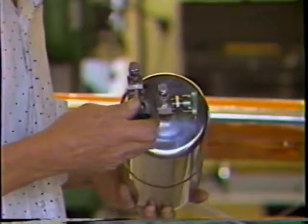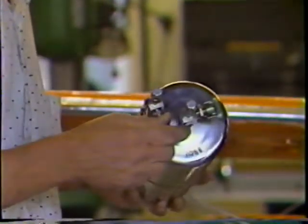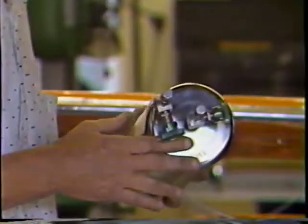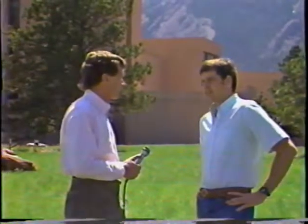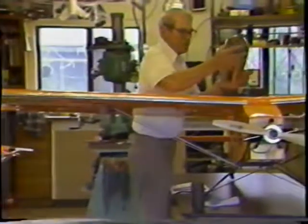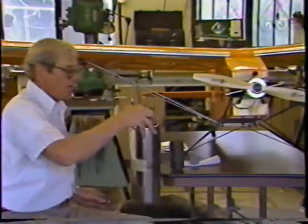The system that we'll put on it to collect air samples will be fairly expensive, and we'd hate to lose it. We measure concentrations of compounds at the parts per trillion level. That would be like if you gave every person in the world $10 worth of pennies and then hunted for a particular penny. So tiny concentrations of contaminants can really ruin our system, and all of that has to be tested. So I'd say the time frame will be this fall before we get a working system.